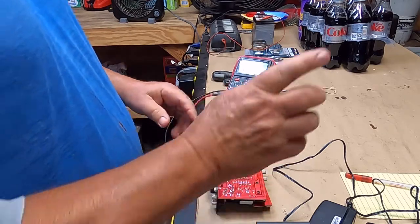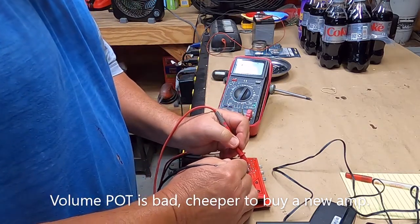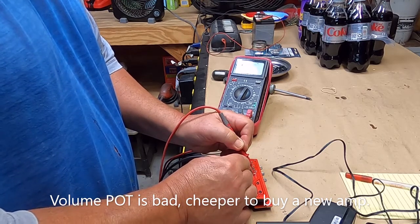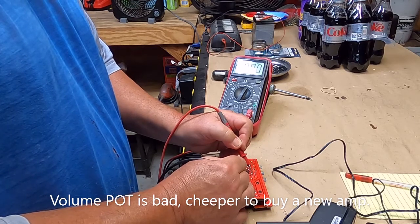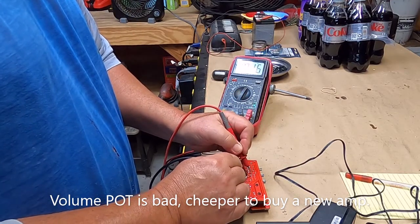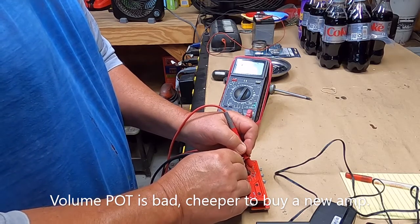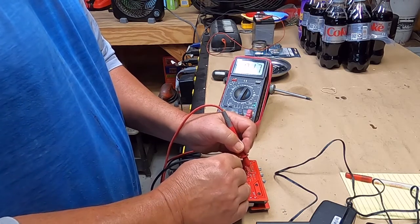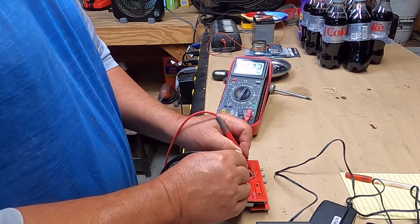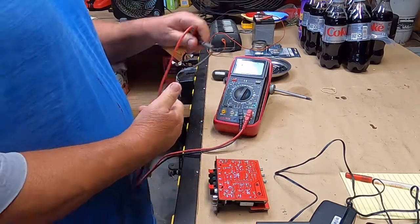As I suspected, this is the bad volume control. If you just barely turn it on, that's where the right speaker is really loud. These are just basically variable resistors, so if I measure one I get a dead short on the other one — it's open. Apparently the one on a dead short is the one that doesn't turn down. I got 0.016 on the 2-megaohm range. Measuring the other side, it's a short or it's open. They should be reading the same. The right side reads 0.024 and 0.022 — pretty close. So yeah, there's something shorted or open; that part is junk.